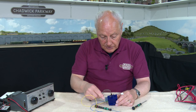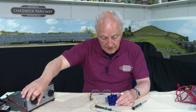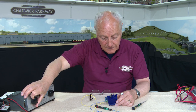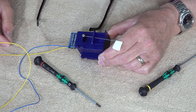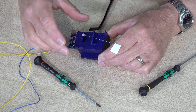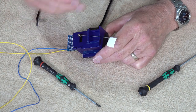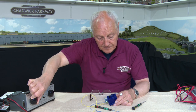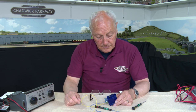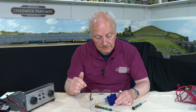So we can get our point to throw both ways by supplying it with 12 volts DC, either one direction or the other, through a double pole double throw switch — easy. But we did speak about switching frogs. If you're a user of electrofrog points you need more feeds, because you need track power going in and a cable going back out to the frog. My cable colours are red and black for track power — normally black to the back, red to the front — and my frog cables are always green.